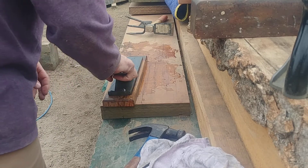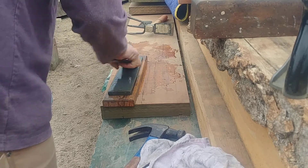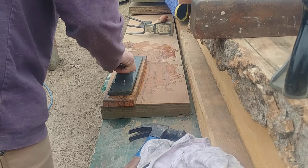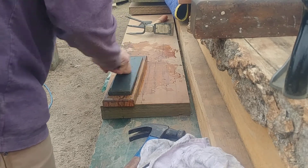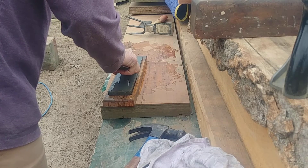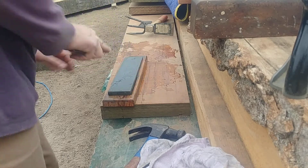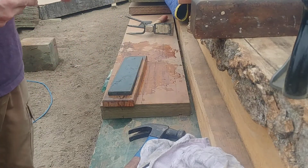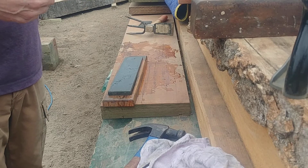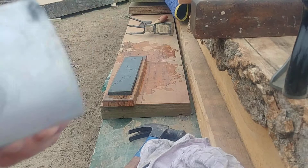If you use non-concentric circles even on an old oil stone like this, it will start getting finer and finer. You'll wear the surface smooth until you resurface it — you can resurface it with a diamond plate if you want, just like you do with water stones. All right, I've got a burr all the way across now.